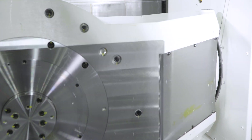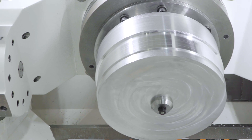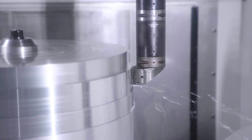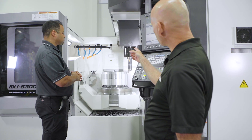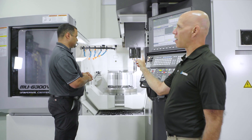Our A-axis has dual cam rollers. Our C-axis is direct drive and in lathe mode it can spin to 800 RPM, with a maximum turning diameter just shy of 33 inches. The table weight is 1,320 pounds — it can hold that anywhere on the table. This is fitted with an HSK100 10,000 RPM spindle, 35 horsepower.